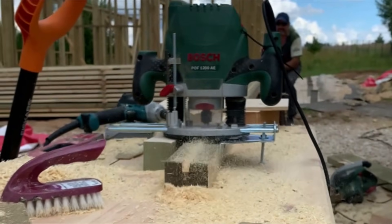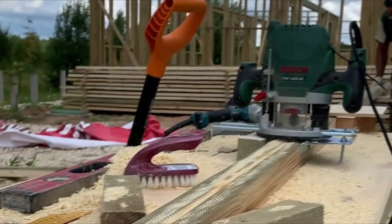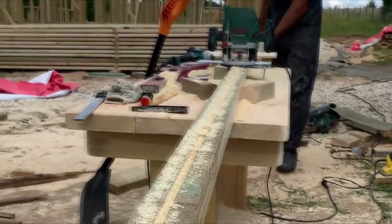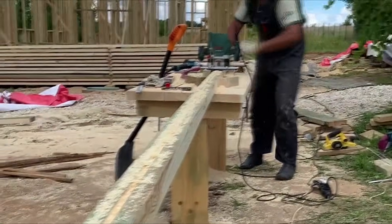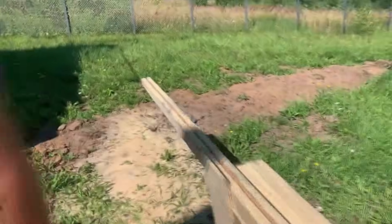So we started simply cutting the 200mm board into three beams with widths from 60 to 65 millimeters. Next, we had to make a groove 15mm deep and 10mm wide in these beams. For this purpose, I bought a Bosch POF 1200 AE vertical router with 1200 watts of power, which, as it turned out, was insufficient to make the required size grooves in 112 beams — that works out to 638.5 meters to be cut. I came up with the idea of mounting the router on a table, attaching guides and receivers, and passing the beams through this way. One beam was passed through twice: the first time 7 to 8 millimeters, the second time 15.